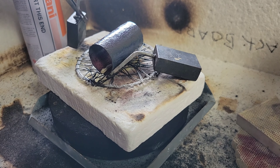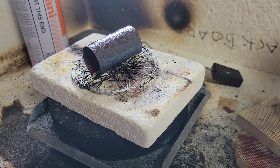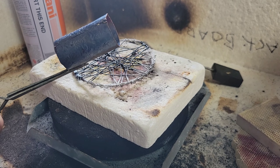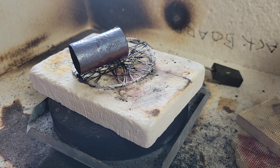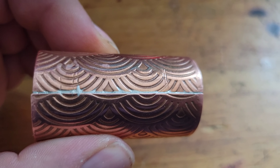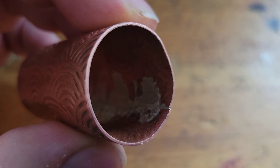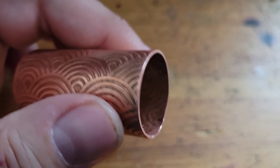We can do all sorts of things — you'll see in the example I show at the end of this, which isn't this piece, I'm redoing this one. It's not even this pattern, but it shows a good example of what is good here. You can see we've got some gaps on the outside — not very good. So we're going to take the torch and give it a couple of flashes to see if maybe we can draw some of the solder out. It sort of works. Here is an example of what we're looking for — a little sloppy even, but a particularly good example of an even solid bead. You can see on the inside how it spreads out. To prevent that on the outside, we actually use a graphite pencil and it keeps it contained.